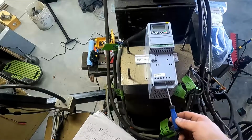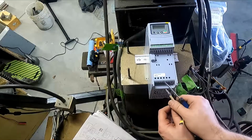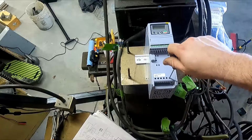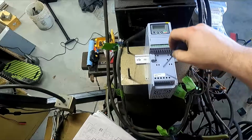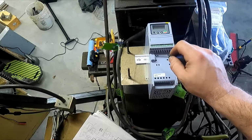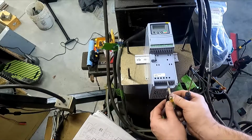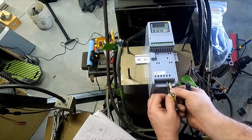There is a braking resistor, like positive and braking resistor, but it doesn't matter. It's just a resistor. It has no polarity. It's just a place for this to dump excess heat, which will let you put a higher deceleration rate. In our previous video where the drive would have tripped from decelerating too hard, the braking resistor, which is a box over here, and it's just a big resistor, will take that heat.